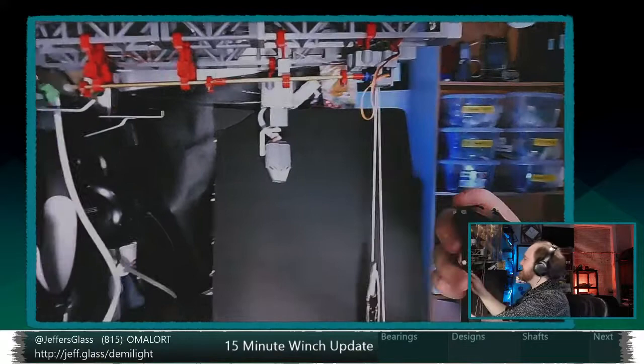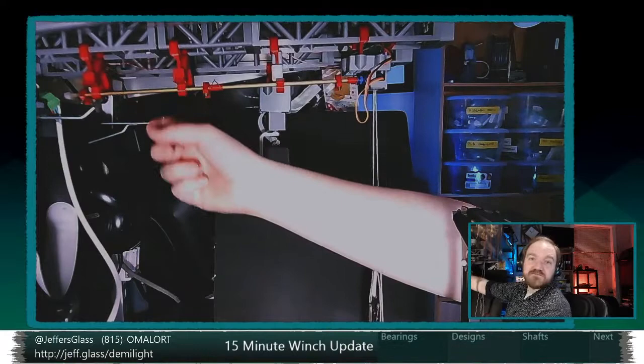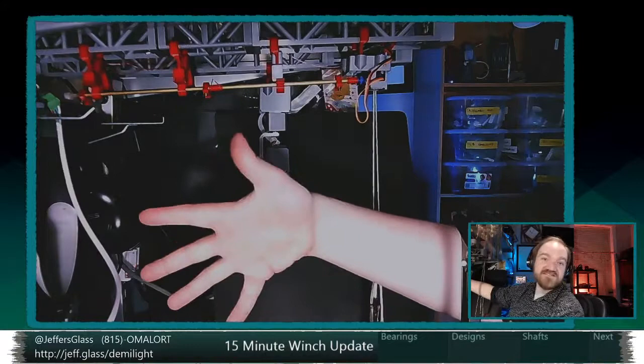So what I imagine is a long shaft coupled to that ratchet mechanism, and it will have three or four small winding barrels attached to it. So we have one mechanism here that's doing all the ratcheting and the lifting, and then we'll have three, maybe three or four spools that hold whatever our stand-in for aircraft cable is, whatever our line or twine happens to be.